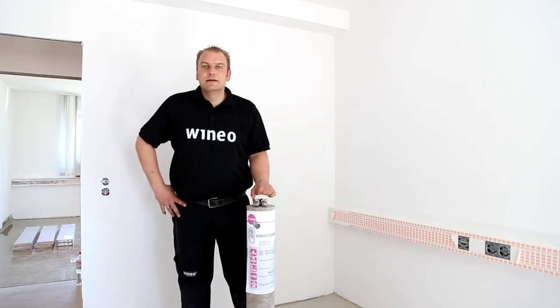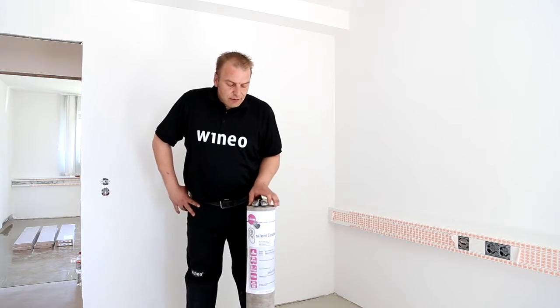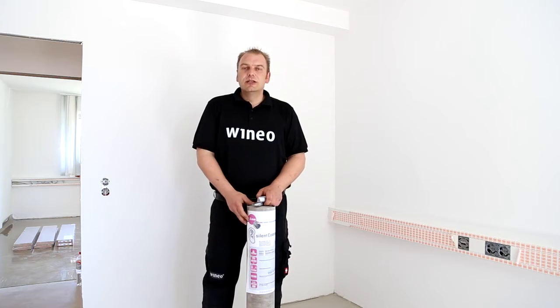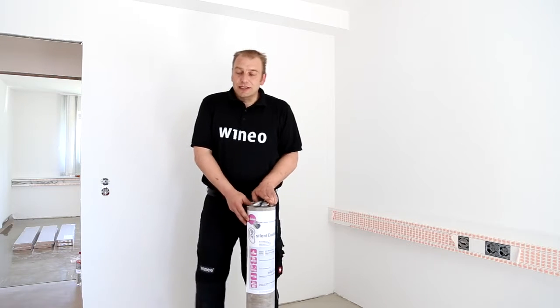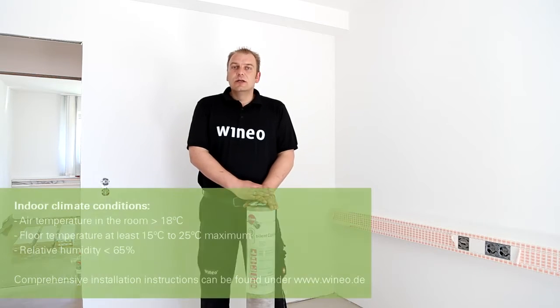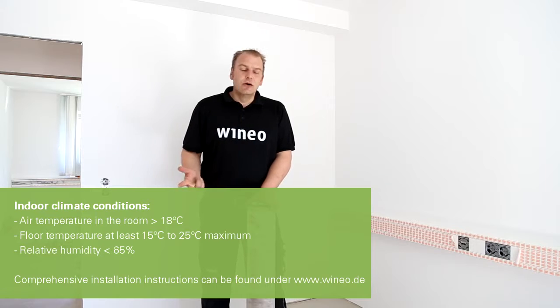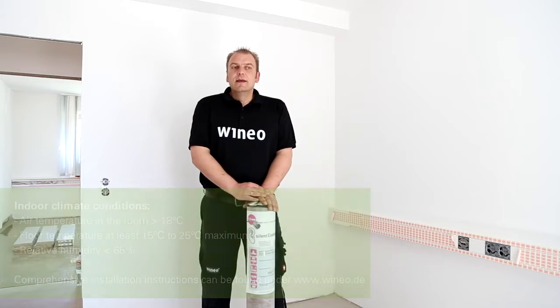I would like to explain to you the simple installation of Wineo 1000 in conjunction with our Silent Comfort underlay mat on which the Wineo 1000 flooring will be installed afterwards. We have to bear a few things in mind, for example the subfloor, which must be permanently dry, even, clean and load-bearing. That's why it's essential that I do an evenness test. A tolerance of 3 mm over 1 meter is acceptable.